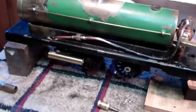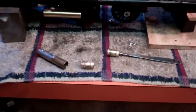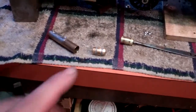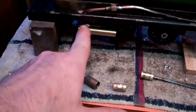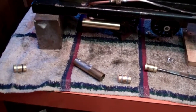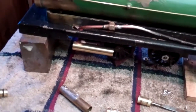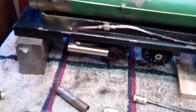So I fired it and it didn't run worth a damn. With the original cylinders and original pistons, there was so much steam leaking out of the cylinders and the fit-up of the piston in the cylinder was terrible. So the first thing I did is I made new cylinders for it, machined them out of brass, and reamed them to a good size using a reamer. I checked it with gauge pins and had a nice .375 bore in that.